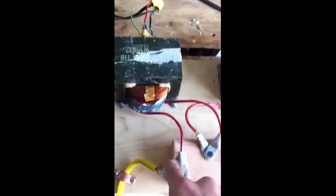Out of this side, from this pair of lugs screwed down here, there's a cable — actually a jumper cable — and this is my ground clamp. On the other side, you go through here, through that coil, back through here, through this coil, and then through this side of lugs here. And this is my stinger, the electrode holder. So one end goes to ground and the other end goes to the electrode.